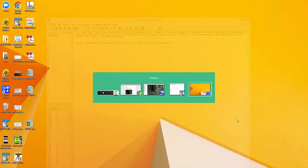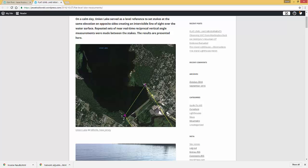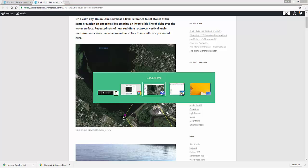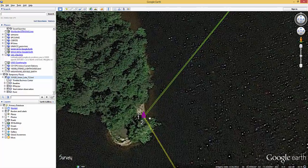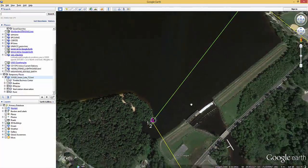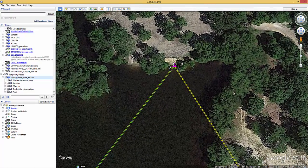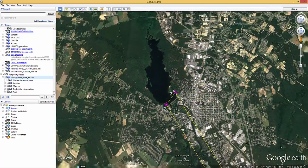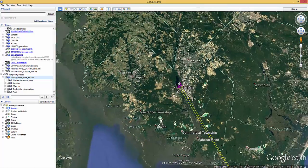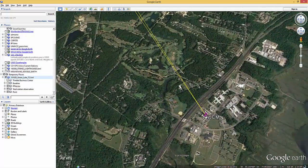Let me talk about this for a minute. This is Union Lake in Millville. I set some points on either side of the lake — two stakes on the shore of the southwestern side and two stakes over on the northeastern side, near a boat ramp area. You have good visibility across, and it turns out this is about a half a mile across. You're also seeing the vectors I processed from a continuously operating reference station, which I pulled from the internet.